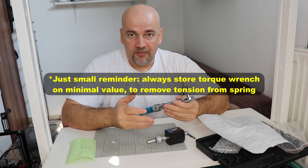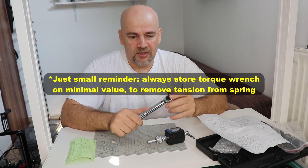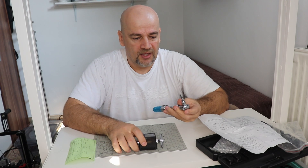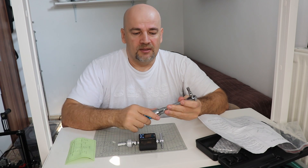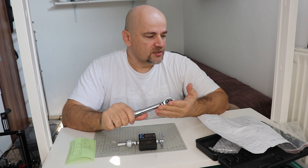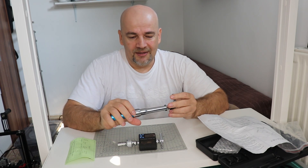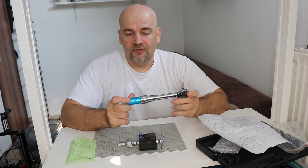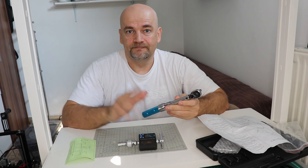About its accuracy: I'm quite happy that it is reasonably accurate. The repeatability is important for me in the creep test coming soon — I checked it with this torque wrench and it was always within 0.1 Nm or less. So I'm quite happy about that and I can use it in the creep test. And of course I can use it for nozzle changing, because now I know how to set 2.5 Nm to get the correct torque for nozzle replacement. If you have any additional comments about this torque wrench, please leave me a comment. Thank you for watching and see you in my next video. Bye.